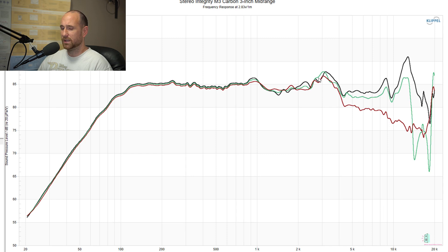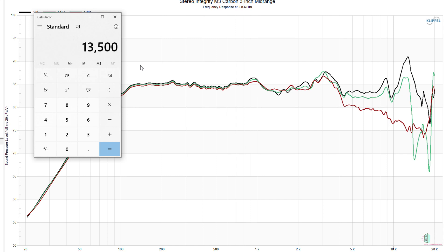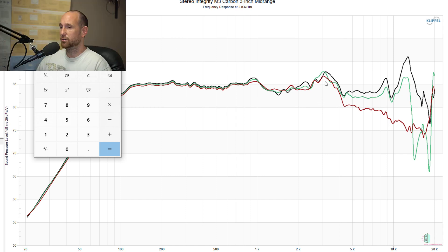There is another bump here — I'm not exactly sure what this bump is. Even though it's minor, it's worth noting for linearity; it may be attributed to the dust cap but I'm not a hundred percent sure. Then once you get beyond that, you get into the beaming point. With this speaker being a three-inch, the actual surround-to-surround distance is about two and a half inches. If you do the math — speed of sound 13,500 inches per second divided by two, because I always use half-wave for determining the beaming point, then divided by the effective surround-to-surround distance — that's theoretically where beaming should occur, and you're in that ballpark based on these results.